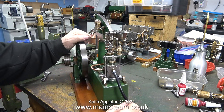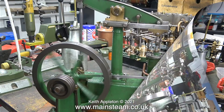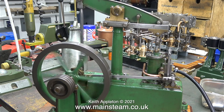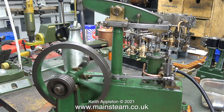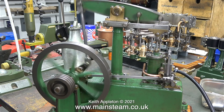A few clips back I was oiling the engine with steam oil, which is very thick and sticky. The thick sticky steam oil fills the gaps in the worn bearings, therefore cushioning the knock so it's not as noisy.